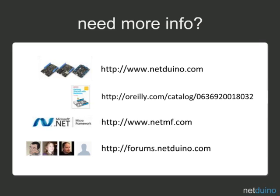Awesome. Thank you. There's a few folks asking about the new microcontroller. Can you talk any more about that? So the new Netduino Go uses this amazingly fast STM32F4 microcontroller. It's the new Cortex microcontroller family, which means that you actually get more than one instruction process per clock cycle. The bottom line is it's fast. It's 4+ times as fast as the original Netduino microcontrollers.